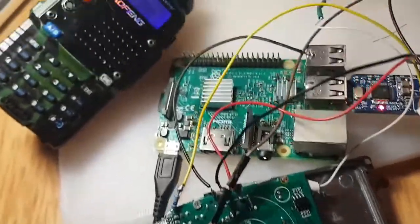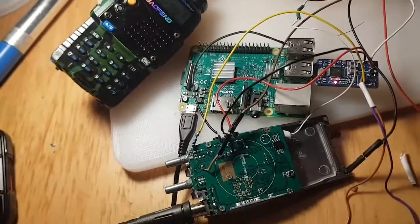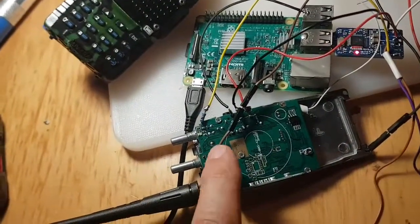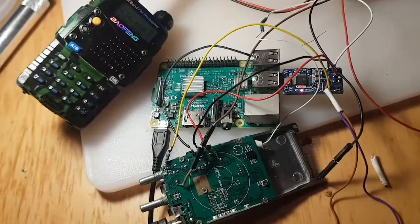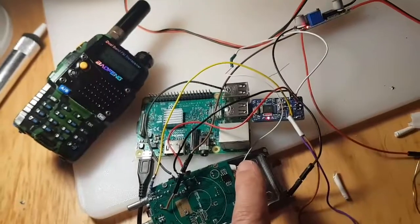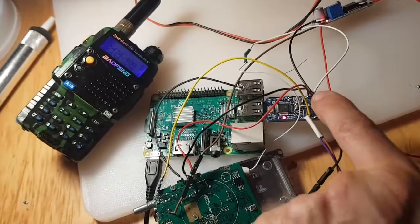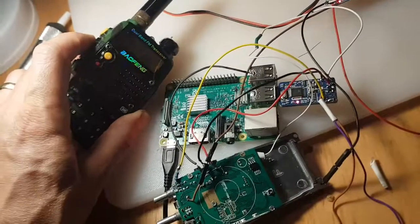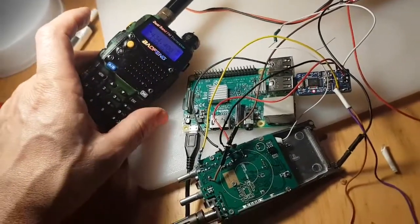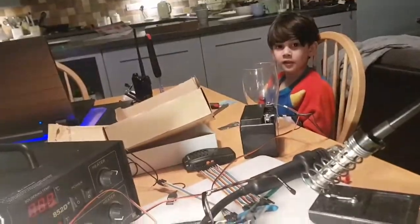If you look at the wire configuration now, have a good look. So we've got the power, the live power is going here. The COS connection from the white cable goes under the circuit board. Then we've got this red wire is the PTT, which goes to transmit, which I've tested and it works. We're going to test the audio in a minute and we're going to connect to someone. We've got Nico helping out as well.